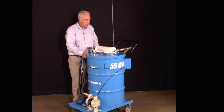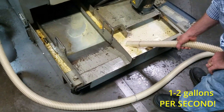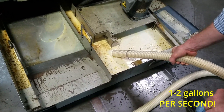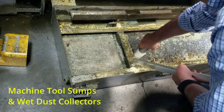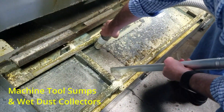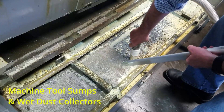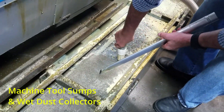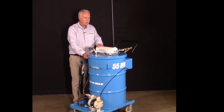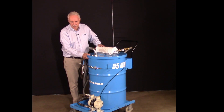The 55MW performance is impressive and productive. It will vacuum 100% liquids up to 100% solids and anything in between. The VacuumX Venturi generates up to 16 or 18 inches of mercury, depending on your compressed air supply, which is three to four times greater than a typical shop-type vacuum. When your job is to make parts on your machines or to keep your shop safe with dust collection, time is money, so the job is to get your equipment back into operation as soon as possible. The discharge pump is rated for 15 gallons a minute.